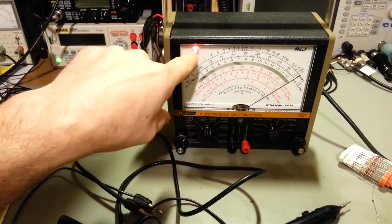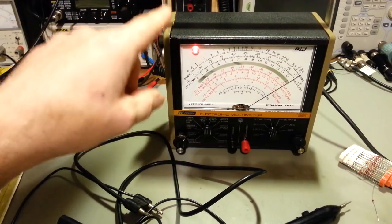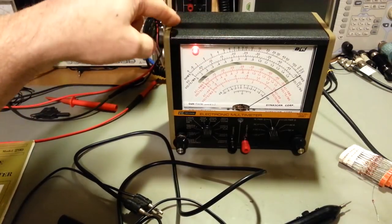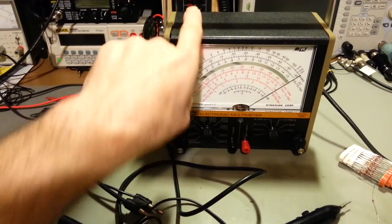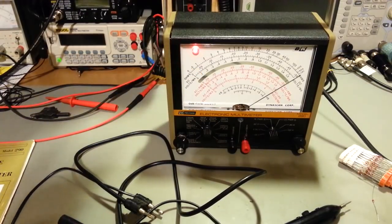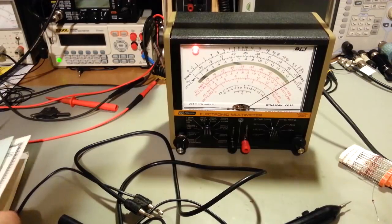One wire goes down to the circuit board, and then the other wire goes to a resistor that's just hanging up off the board. It's a 120 ohm resistor, and then that resistor goes down to the board. Well, if you look at the silk screening on the board, the silk screening just shows the resistor attached to the board, but it's not. It has a light bulb in series with that resistor is what they've done. And it's a modification, but it's a factory modification.